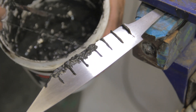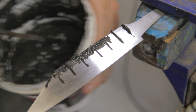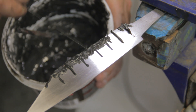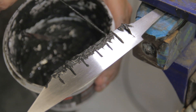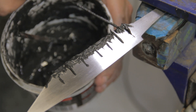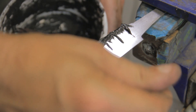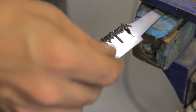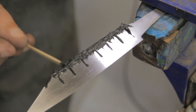Again leaving plenty of meat between the clay on the spine and the drop towards the edge. One thing to pay close attention to is I'm trying to keep my clay layers fairly consistent — a little bit thicker up towards the spine and then tapering with the ashi. I'm not particularly happy with this section, so I'm just going to come in now with a toothpick and add some of that reticulation that I desire. And of course if I find any voids or zones that just don't suit me, I can always come back later on and add a little bit here and there.